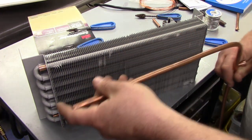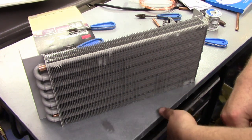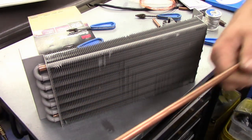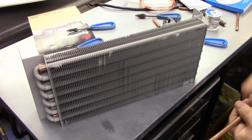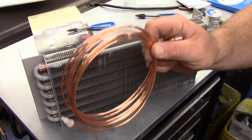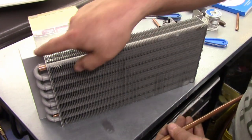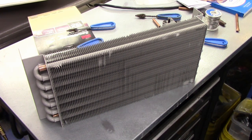And what we're going to do when we get there is we're going to cut the refrigerant lines from the compressor, which is actually below this evaporator. We're going to pull the evaporator out, and I'm going to feed the long section. I'm going to leave it really long for now. We're going to feed that down the hole behind it along with the cap tube. So that's the plan. So for the time being here, we are going to get this all connected. So I do have to clean it out. And yes, I'm going to use Stay Bright. I know a lot of people don't like it. It works for me. If it doesn't work for you, then don't use it. But it's going to work perfectly fine for me, and perfectly fine for this application.